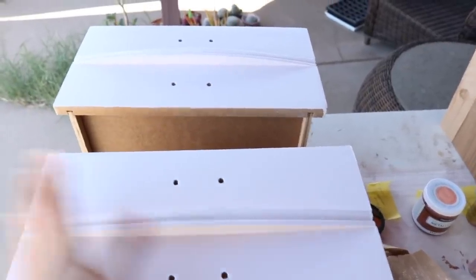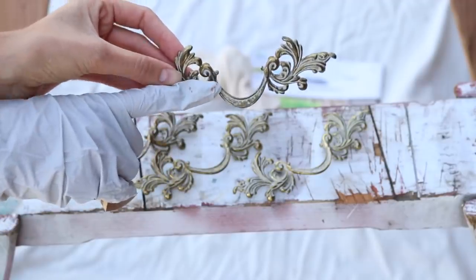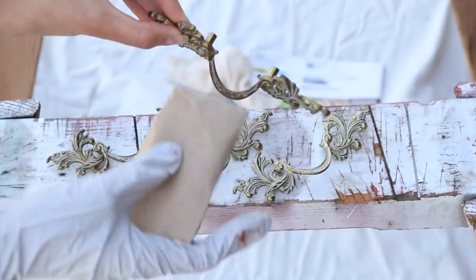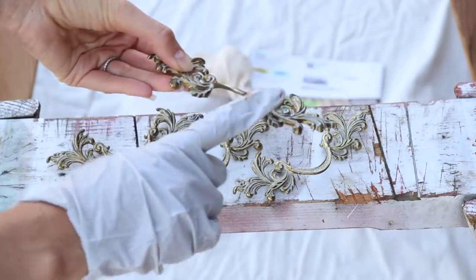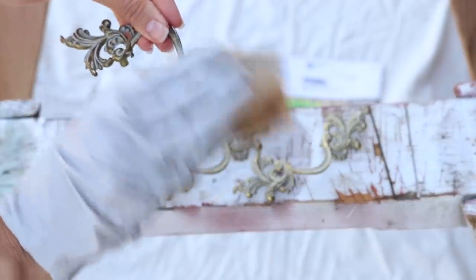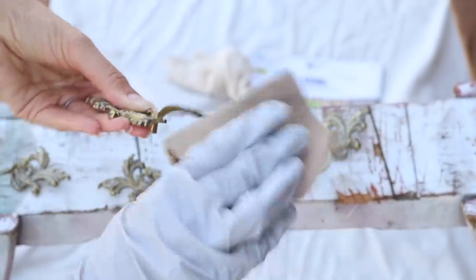After sanding, I dusted everything, did the second coat, let everything dry overnight outside, and everything is ready to go in. Before we paint our hardware in rose gold, we're going to prep it by sanding it. I've got a fine 220 grit sandpaper — we're just sanding it really lightly, basically just roughing up any really smooth, slick surface of the metal so the paint can adhere to it better. Just a light, quick sand is enough to rough up those smooth surfaces.